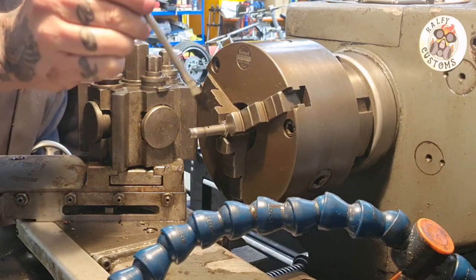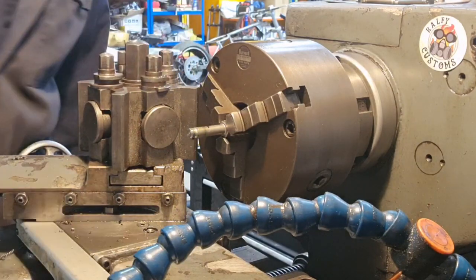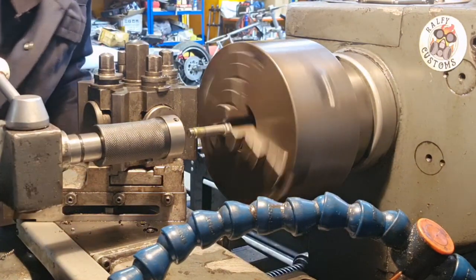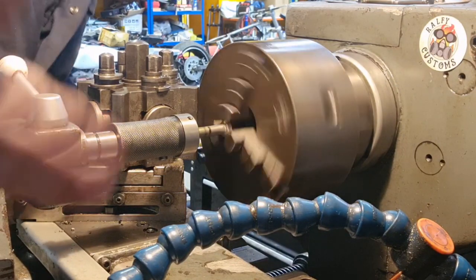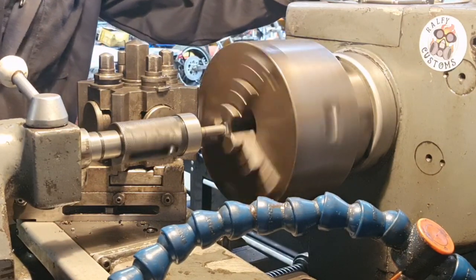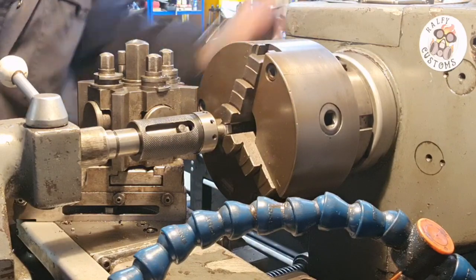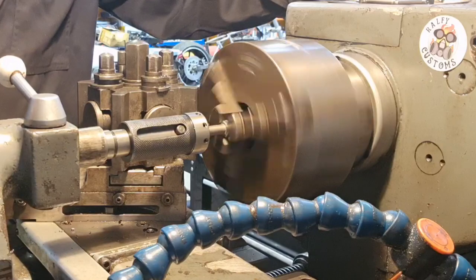So we're going to lube him up and lube up the die. It should take on the thread and then start to cut, but I envisage difficulties. So, there may be trouble here. Right, we'll get that about there. Tighten the tailstock. And on the clutch. Wind him in. Wind you bastard. Go on. Yeah, yes. Reverse him out. Job's a good one.